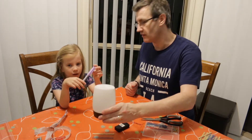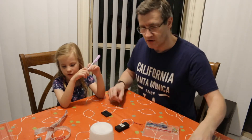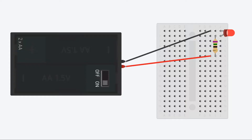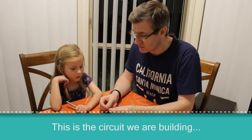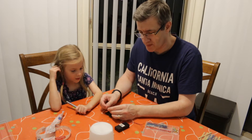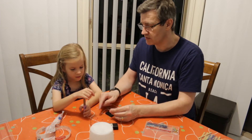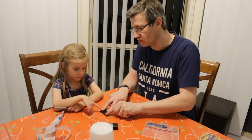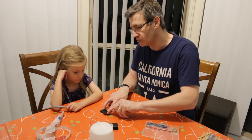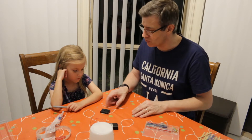So that's going to be for the outside of the night light. This is the permanent marker that I'm going to choose. So the long one is the positive one, and the positive on the battery is the red one. So the long one has to go on to the positive lead of the battery. All these holes in the breadboard are all connected — all these five here, all these five, and so on, all the way down. Each five in a row are all connected.